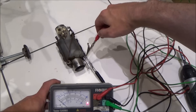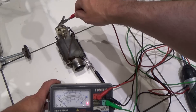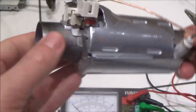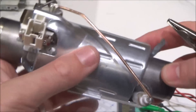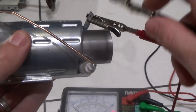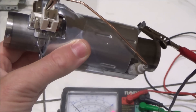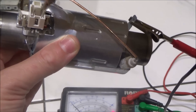Just a quick look at it — if I put one lead to earth and then touch either of the contacts, I can see the needle going across. So these contacts are in contact with earth, and I think that's my problem. I ordered a new water heater and here it is a few days later. It cost me £21 — it's not the original part but it looks okay, we'll give it a go. Now if I put one lead to earth and tap them together the needle shoots across, but when I touch both contacts on the new heater the needle's not moving. So I know the old water heater was definitely faulty. I'm going to fit this in place of the old one and hopefully the dishwasher will work again.